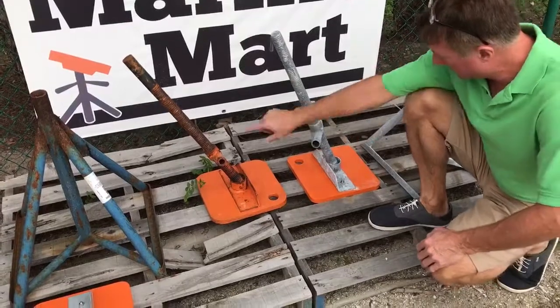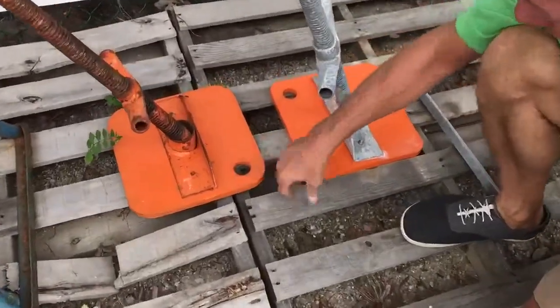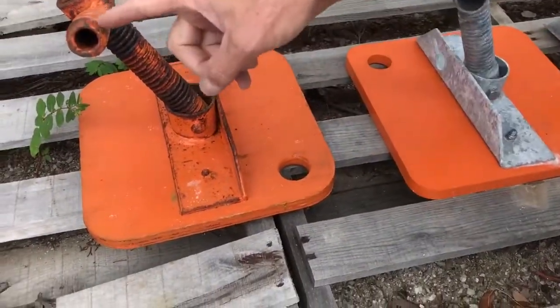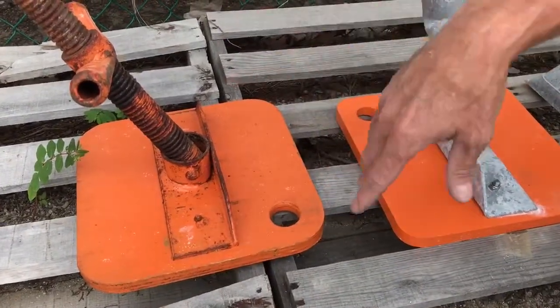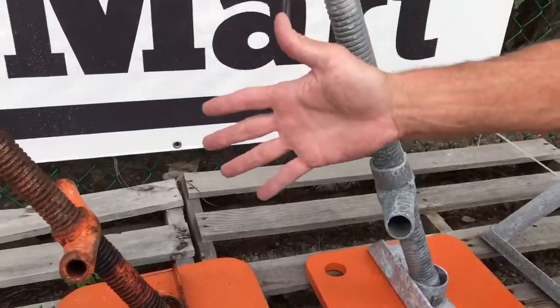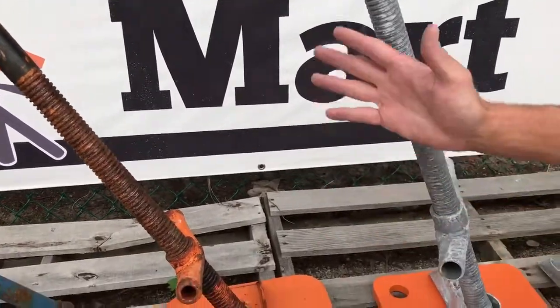Look at that head — look at this head. Right here you have a steel screw that barely pops through. It's dipped in paint. As soon as you torque this and get pressure out on the edge, that'll break. It doesn't look like we've ever done that here — we've just sprayed this. This is a corrosion test for a few weeks, and you can see how this looks. This is how it looks out on your yard after however long.